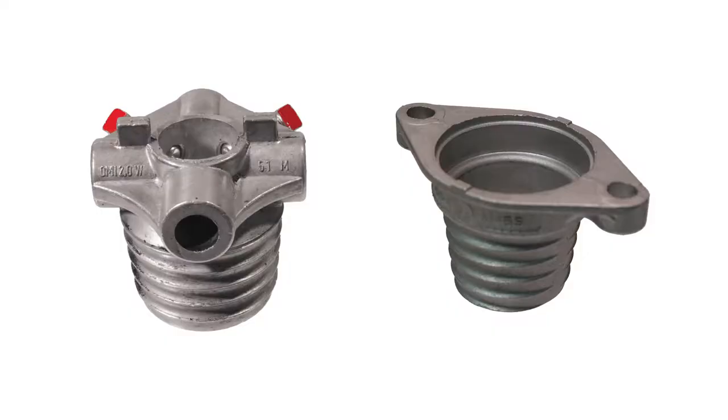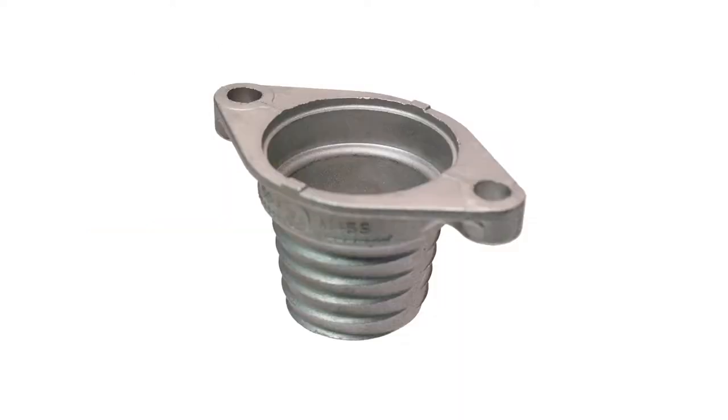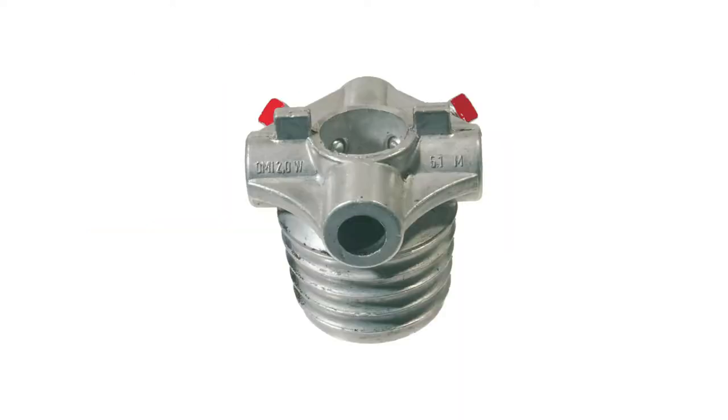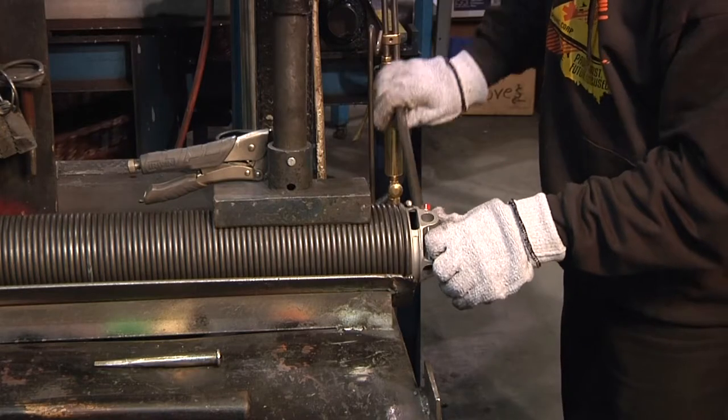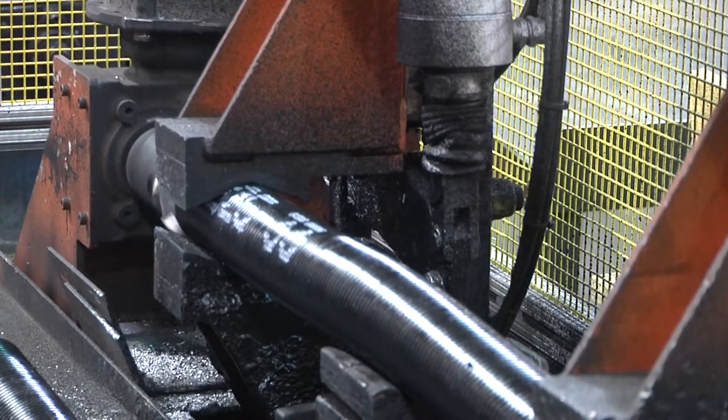Connecting the spring and its lifting force to the rest of the assembly makes cones critical to the counterbalance assembly. Cones can come in many different shapes and sizes. Typically, there is always one stationary cone and one winding cone on each torsion spring. There are two main ways to assemble cones on springs: manually in the field and mechanically at the manufacturer.